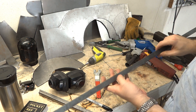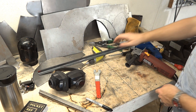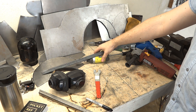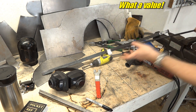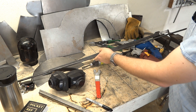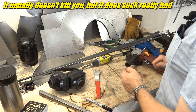To get it accomplished, I have a piece of angle here — eighth inch by three-quarter by three feet, purchased at the hardware store. You can get small sizes of steel at hardware stores usually, and you have the luxury of just buying one small piece at triple or quadruple the price of a normal steel yard. I also got this: a three-eighth by six feet round rod. Now these are both weldable steel, which means they're not galvanized, so if you weld it you don't die from zinc fumes.